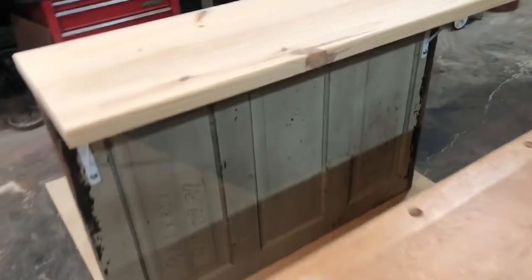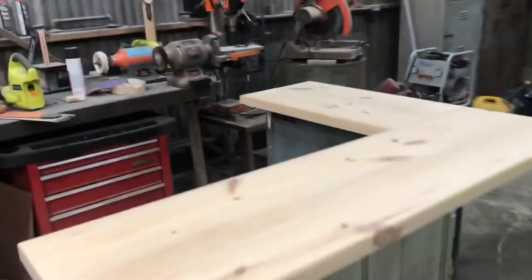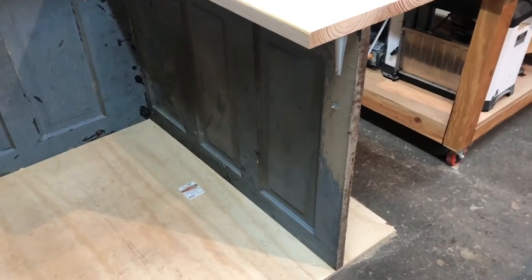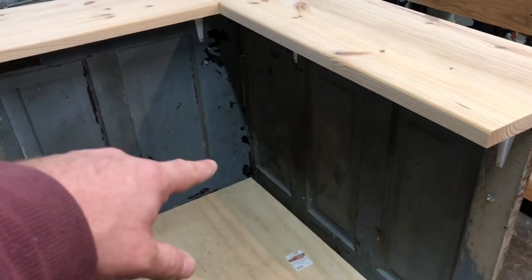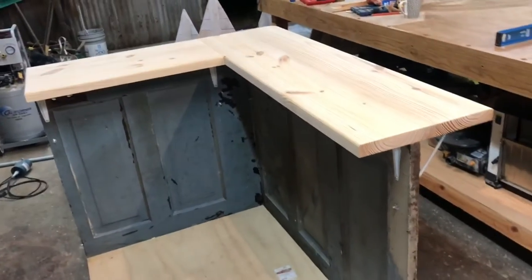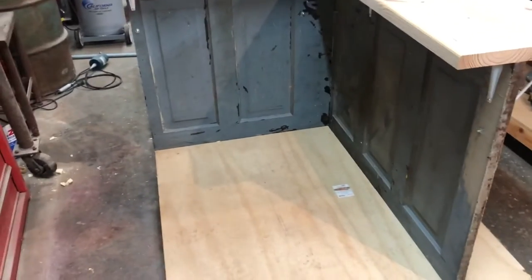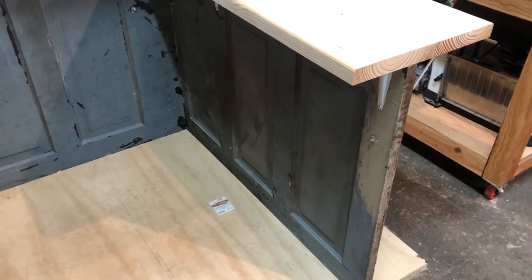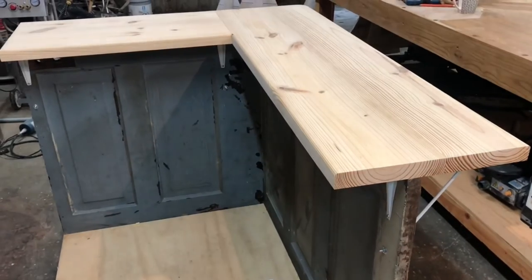That's walled off and employees will enter through this side. I guess it's cool enough for what it is — it's just not my thing. I did talk my sister into using a corbel on that corner and on that corner on the inside, one screw into the door, one screw into the floor, and that'll keep it from people walking by and kicking these over time. Because that corner is just a butt joint that's glued and screwed in from the other side, and that is a lot of leverage — the bottom can definitely move more than it needs to. She's going to use corbels to keep it in place; I think corbels will look better than angle brackets. Yeah, anyway, that's it — one family freebie in the books. I think it'll be all right.